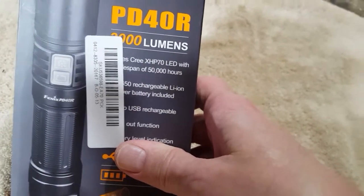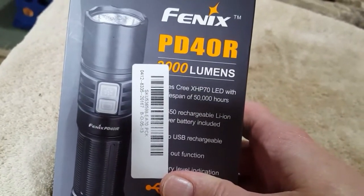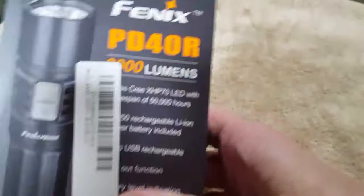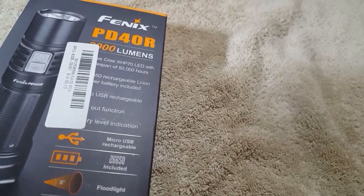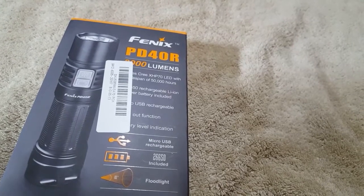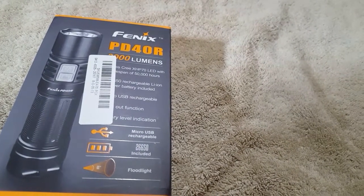The controversy was some time back — mid-2016 — because it's claimed to be a 3000 lumen light. I tested it myself and it is every bit a 3000 lumen light, but it will step down from 3000 lumens fairly quickly. It does that for a couple of reasons, and we're going to get into those reasons. When you find out just how much power goes through there and how hot it gets so quickly, you'll understand why it steps down.